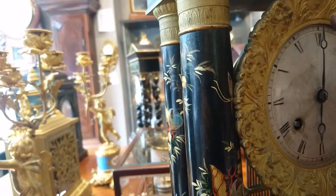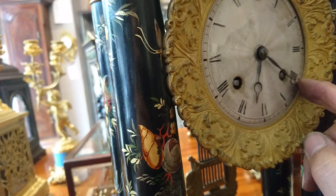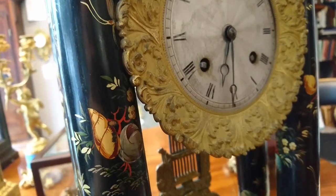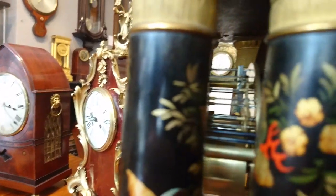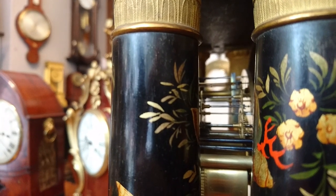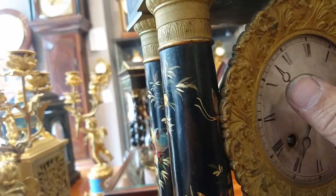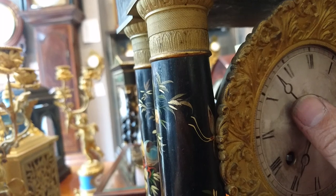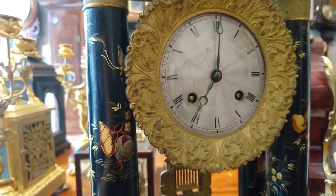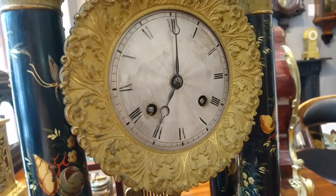Watch this — let it count. If six is the number, don't move on until it's finished counting. If it's ten past six, then you can move on to ten past six. Or if you've got to go around to seven, come slowly up to the half hour because something's happening inside — it's called the warning click. Click it through the half hour, let it ring, and then go on around to the hour. You can just see that turning — on this clock it was about seven or eight minutes to the hour. You don't have to stop it, just be going through slowly.